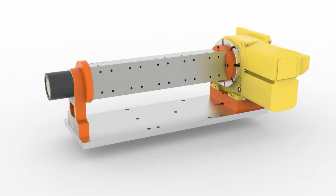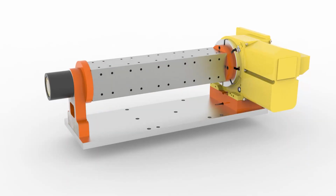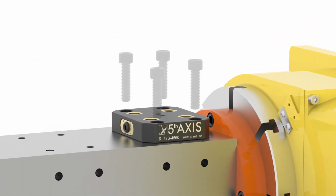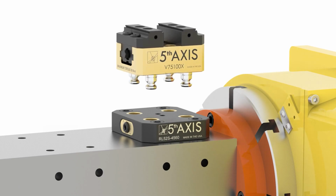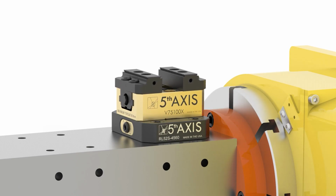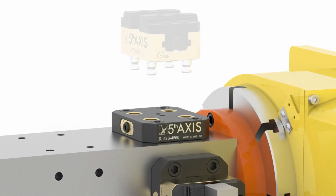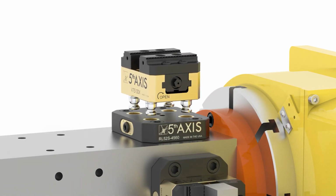Of course, everybody's into this 5th-axis craze right now, the 5-axis machining center craze, and they have their place, no question. But what we're finding is customers coming back to us now and buying tombstones and triangles and so forth, because what they've realized is that at the end of the day, using a tombstone or any kind of multi-sided fixture like this, they have a lot more parts.